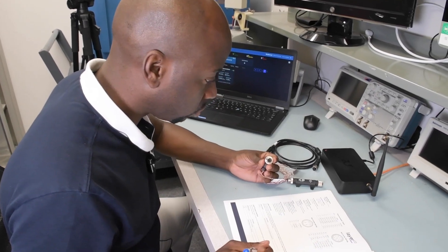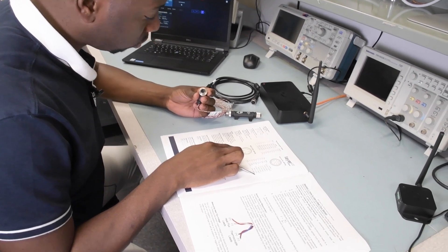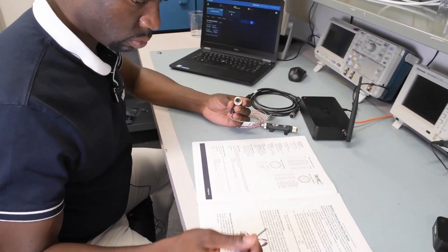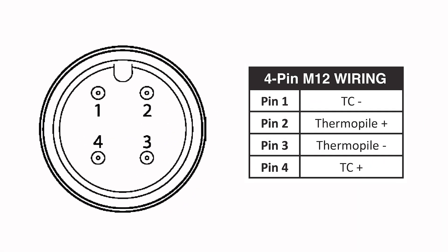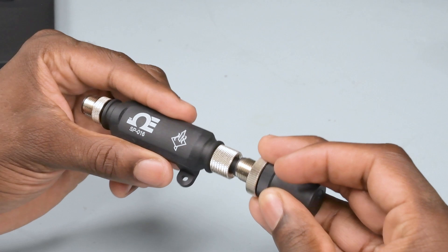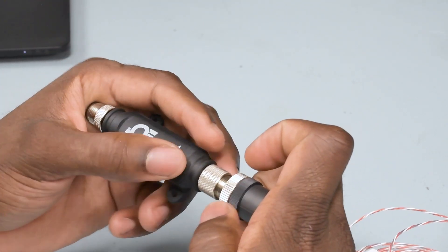First, let's connect our M12 adapter to our heat flux sensor. You'll need to refer to your sensor's spec sheet to determine the correct outputs, and follow the wiring diagrams found in the SP016 Quick Start Guide. So pin 1 goes to the negative thermocouple output, pin 2 is the positive thermopile output, pin 3 is the negative thermopile output, and pin 4 goes to the positive thermocouple output. Now we can connect our heat flux sensor to the 4-pin M12 connector on the SP016 Smart Pro.